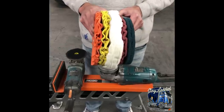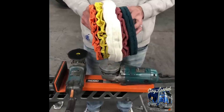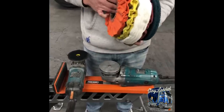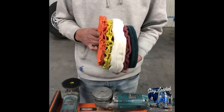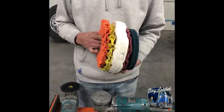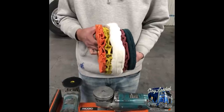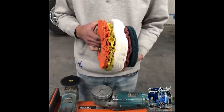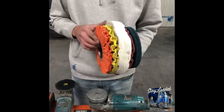For beginners — guys that haven't polished before — I recommend it. It runs at a slower speed and it's a lot more forgiving. The white buffs you literally cannot spin over 2,500 to 3,000 RPM. I try to keep those down between 1,800 and 2,500. I find it leaves the best finish and it doesn't risk blowing them out.